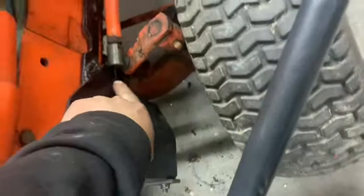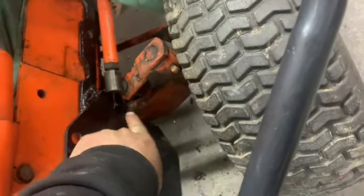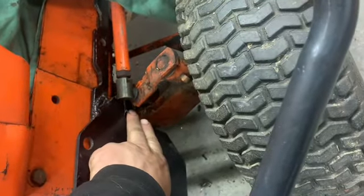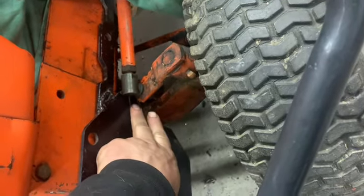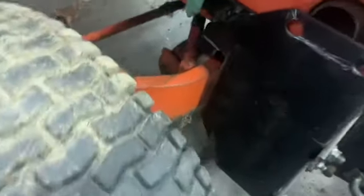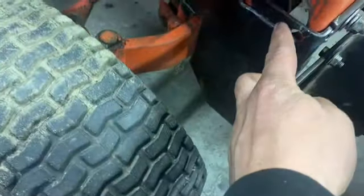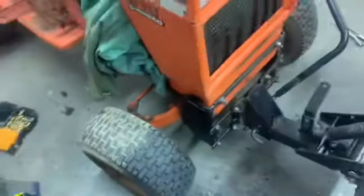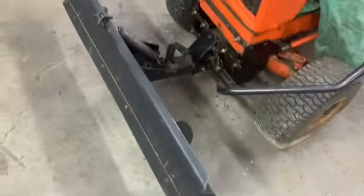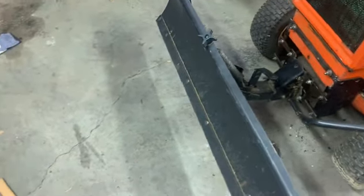Still, I gotta trim these spots down here because if not, the axle when it pivots will hit. But I can trim it right there because it's close to where it stops anyway. I'll do that on both sides, and I still gotta cut this out so that it ain't in the way of the exhaust. So yeah, that's what I'll do. Yeah, so I'll probably set you up when I'm doing some of that stuff.